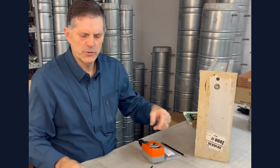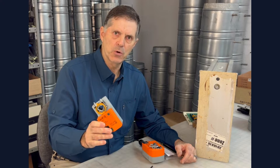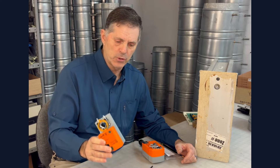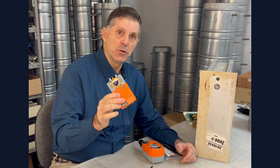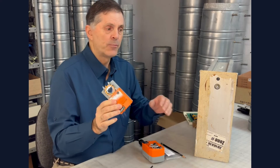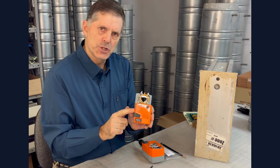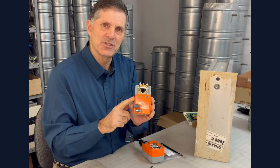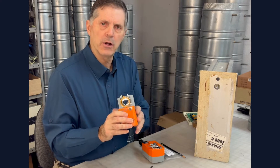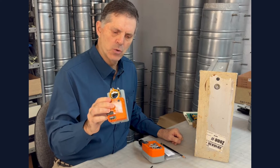There's something else important about this kit: even if you have a zone control panel that only supports a two-wire damper output — perhaps made by Lennox, Jackson, ZTEC, or others where you'll only see two damper outputs — you can still use this motor even though it's a three-wire motor. You will still need three wires from the damper to the zone control panel, but because this is a smart motor with a chip on it, it has some tricks. It will work on an economy zone panel that only has a two-wire damper output — the third wire simply goes to R under the thermostat. So if you're in that situation, this will also work for you.